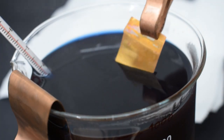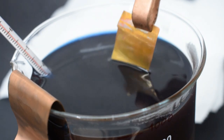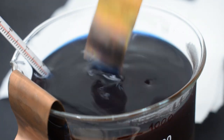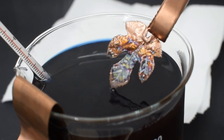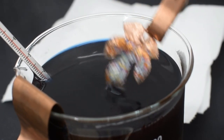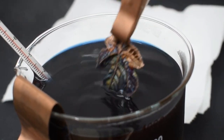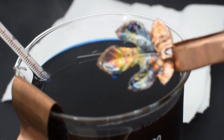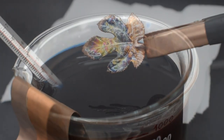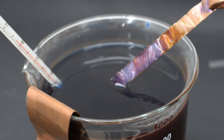This technique of patina involves the dipping of the copper piece into the solution for short periods of time, and quickly moving it up and down in the solution. Be sure not to touch the anode while dipping the piece in the solution. The result is not easily predictable and may lead to an uneven distribution of color or a patchy finish, but it will be a beautiful and unique rainbow color effect. Temperature and voltage are big factors that can determine the consistency of the color and the speed of the process.